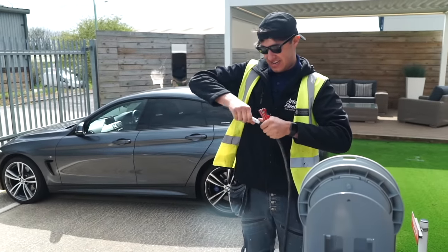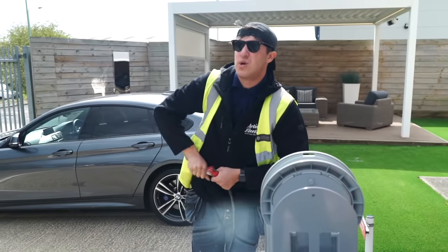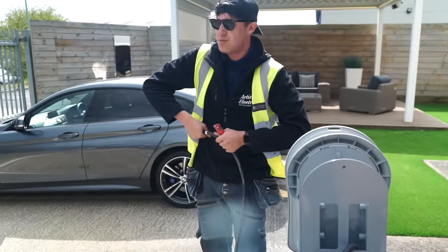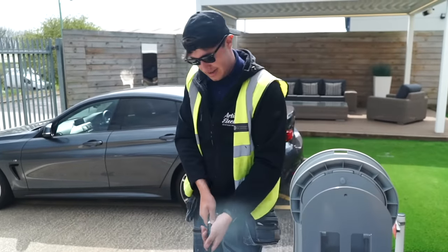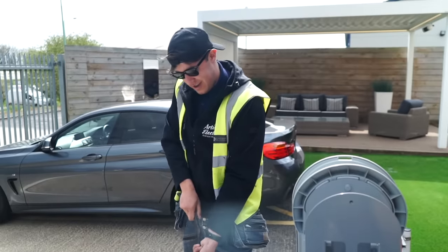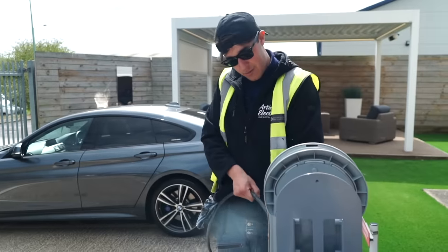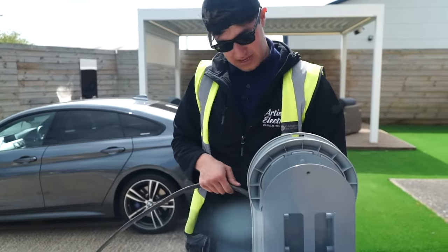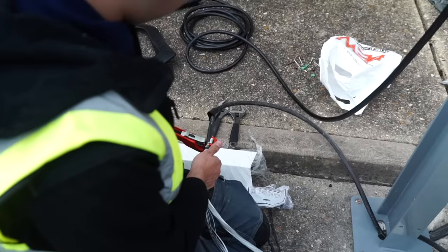It's like when you see SY cable with a stuffing gland — yeah okay, technically you're all right but I don't like it. This boot is actually fine, it's watertight. If you've got an SY cable use an SY gland; if you've got an SWA cable use an SWA gland. And I'm going to prove my point by getting all of these absolutely perfect with no mistakes.